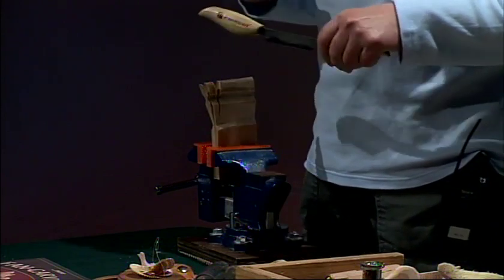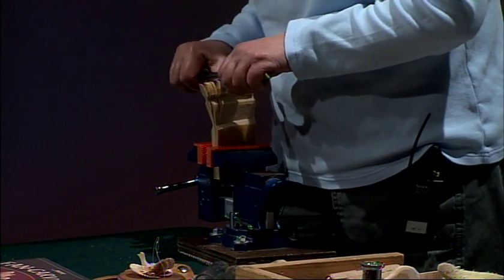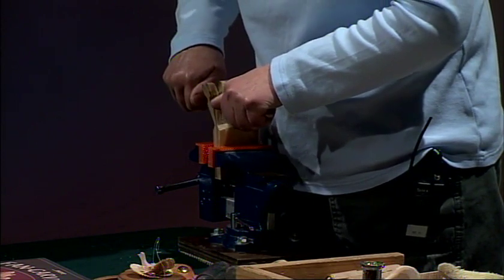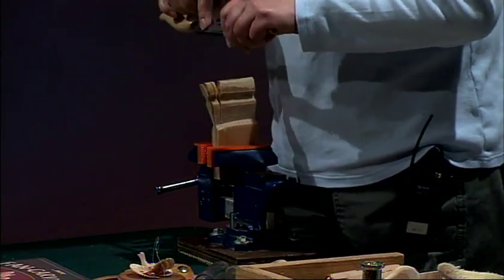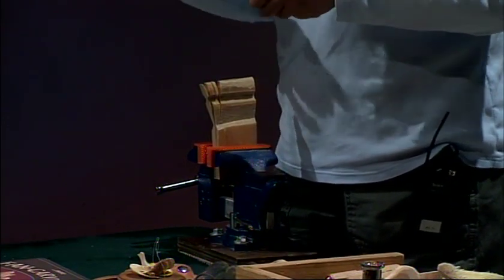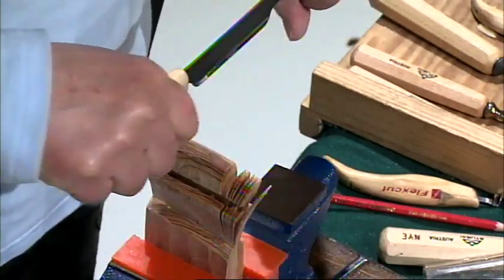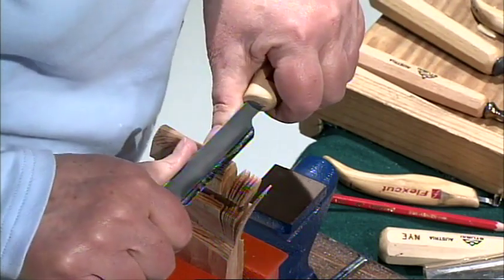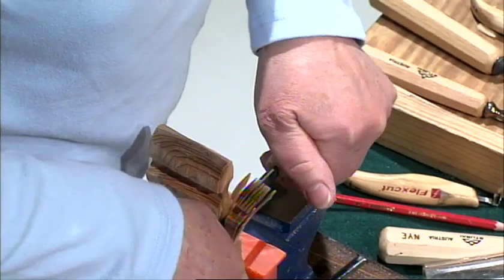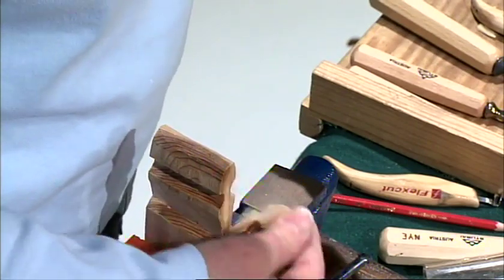Sometimes, if the wood is a little more fibrous, you can start on one side and slice across all the way to the other side, using that whole dimension on your sharp edge. But the main thing is to leave that flat back snug against here, to the point that you're almost pulling both handles back towards you. It'll take me about seven minutes to do this whole thing, so you get the idea.